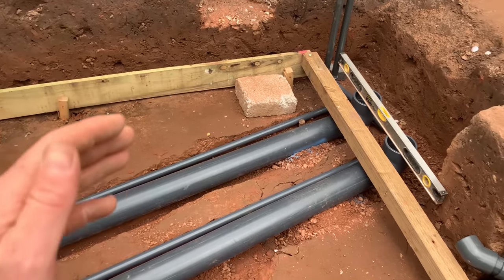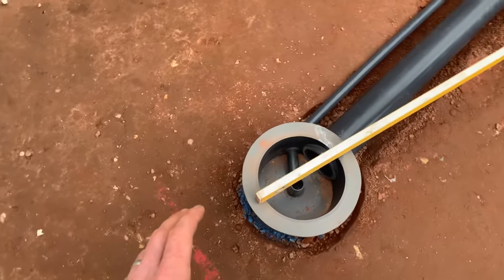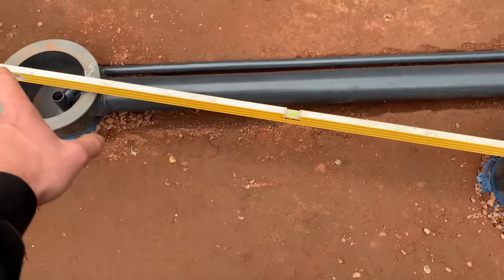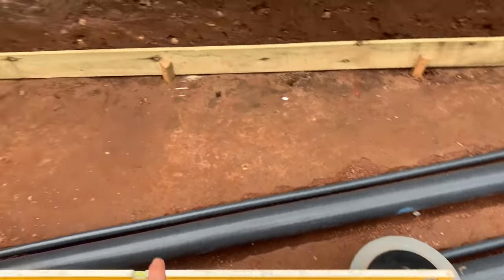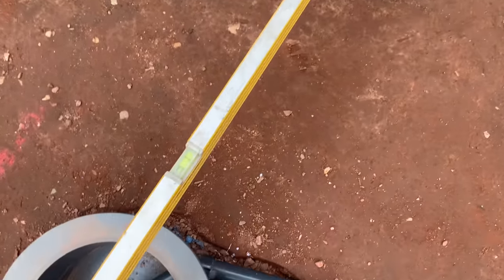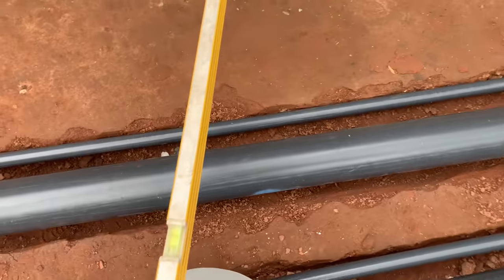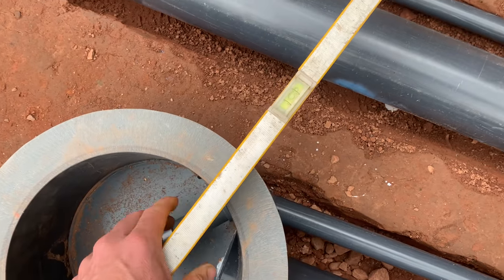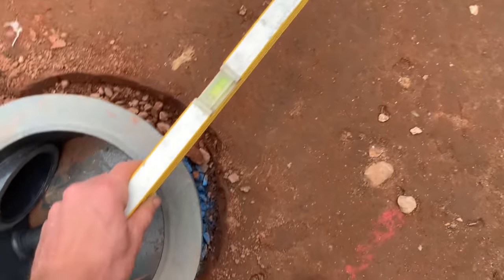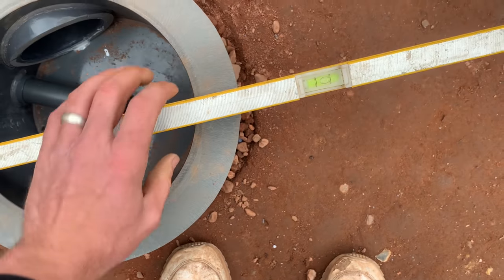Bear with the wind noise a second — it took a bit of working out but I think I'm there. I've made sure that these two drains are dead level — lovely and plumb both ways. I've also made sure there's a slight drop off into both drains. Where the bubble is you can see there's about a five mil gap underneath. I've done the same to this side — exactly the same. You've got to check and check and check and check.